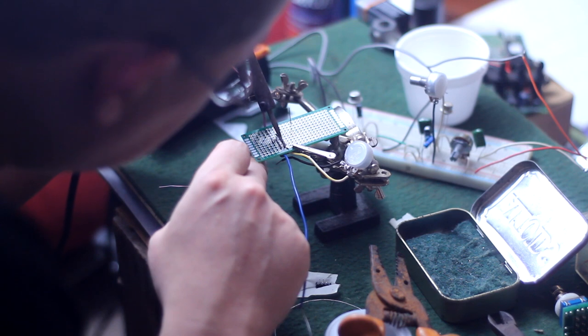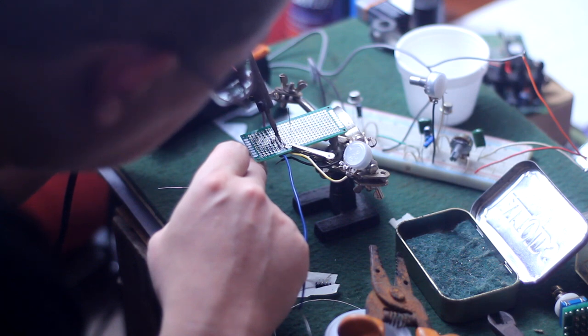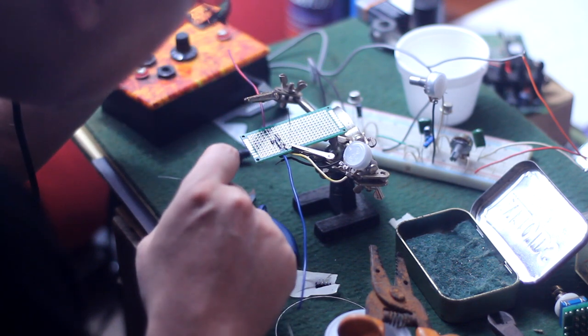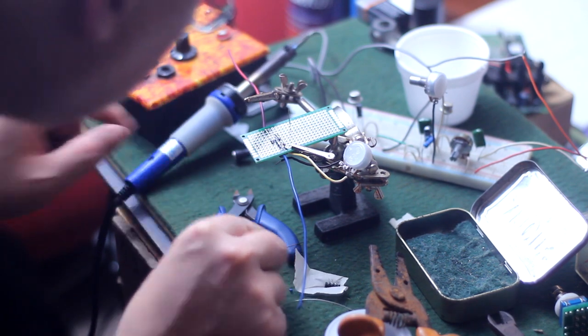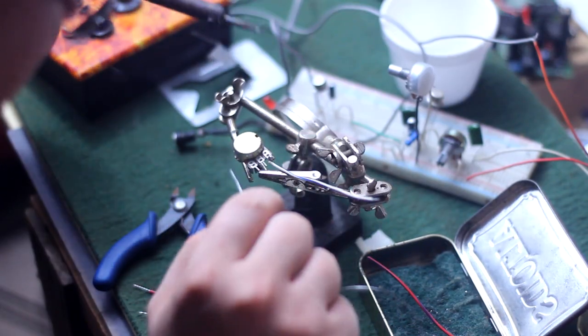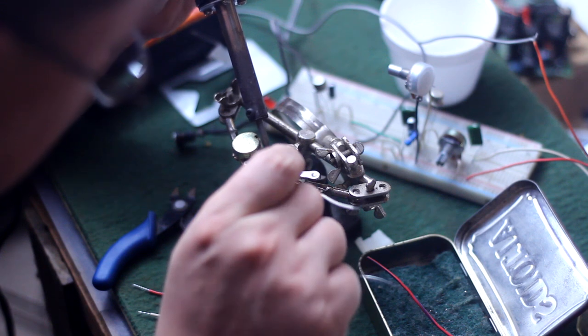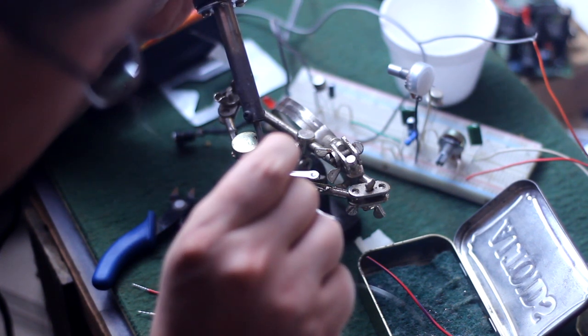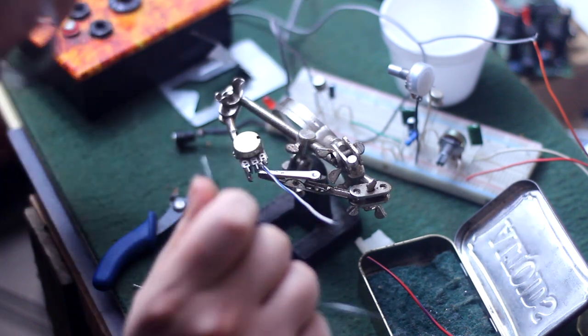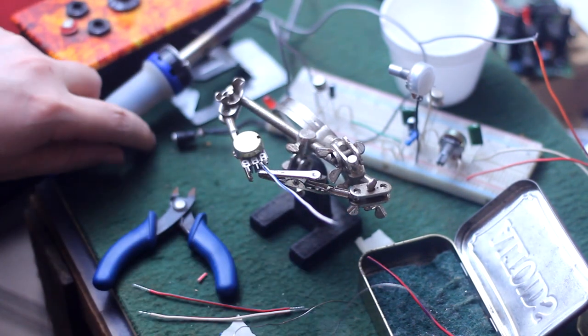And now I'm going to solder on that first bias adjustment pot that I've plucked from the breadboard in the background. What we've got now is that first gain stage from the Fuzz Face I originally built to test the transistors. Before I start to build the Rangemaster section of the circuit, I need to solder up a 10K pot. This is a kind of tarnished pot out of my old stash of parts that I thought I'd use up. That was a bad idea, but you'll learn more about that later.